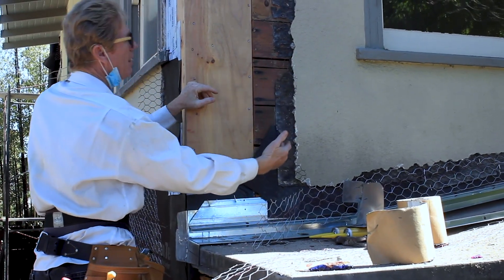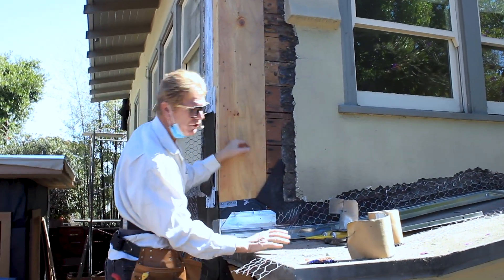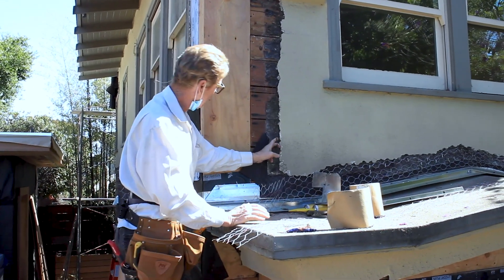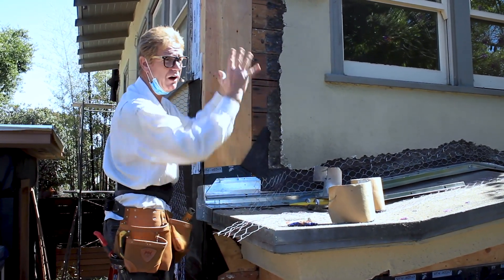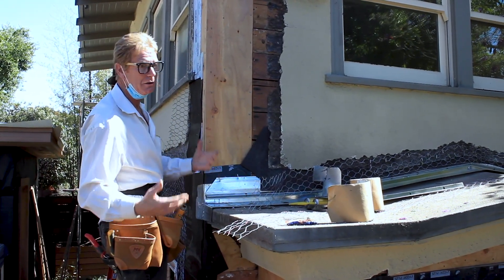It's been broken out great. We ask for three inches. Often there's times where there's not an inch of paper. They got three inches here, which is good. I've seen houses with no wire — the only thing holding up a garage is the stucco itself, so it rots, it deteriorates. It's like our bodies, man — use it or lose it.